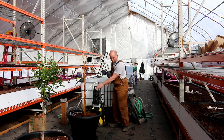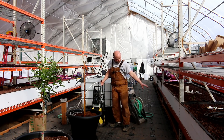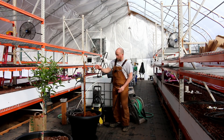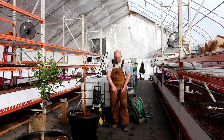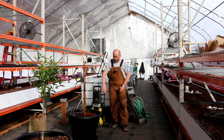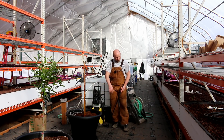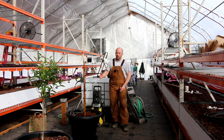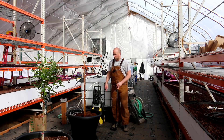We're going to lift this section up right here. We're going to put a pump down there. We're going to connect an automation unit over here. And we're also going to run water and power to the pump and back up from the pump — water from the pump, power to the pump — get the water up in here, bring it up through the floor, and then have it ready to go to all the trees through here.